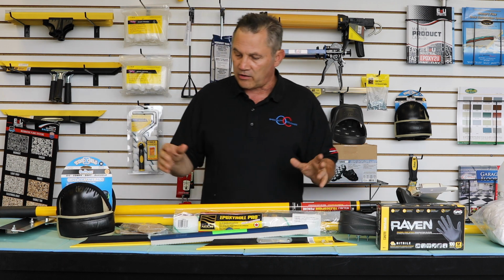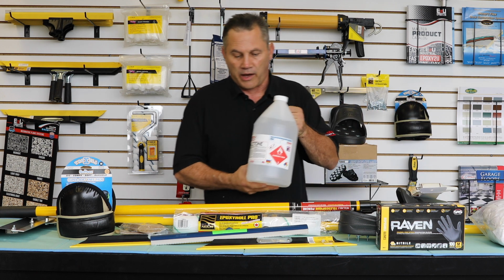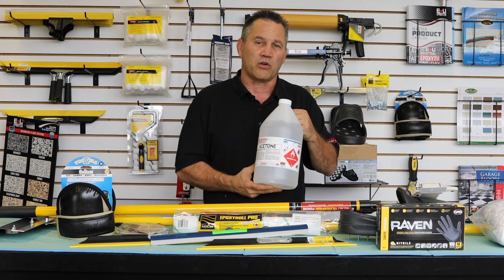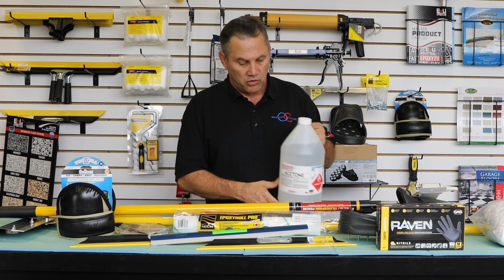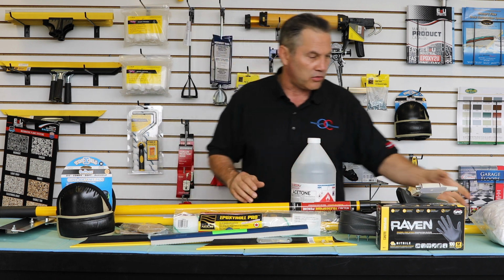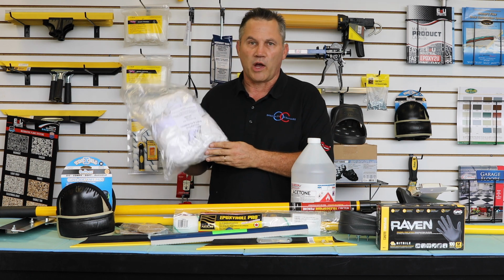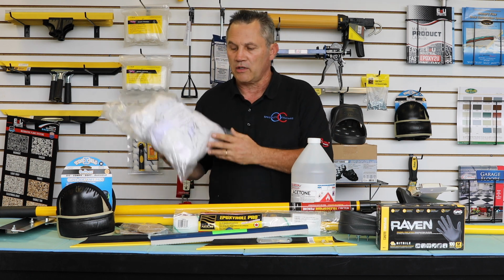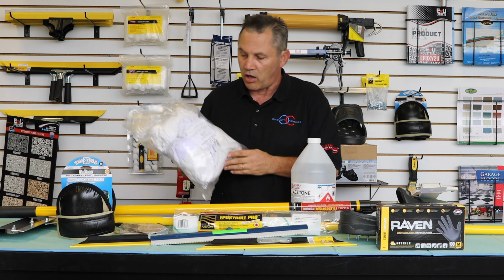Finally, after you've got your epoxy rolled out, brushed out, applied onto the floor, it's going to be time to clean up. So don't forget, out here in Southern California, the only really compliant solvent you have for cleanup would be acetone. So don't forget your acetone. And of course, you're going to need some rags to wipe your hands, wipe your tools, clean off any areas that you got epoxy on that it didn't belong.